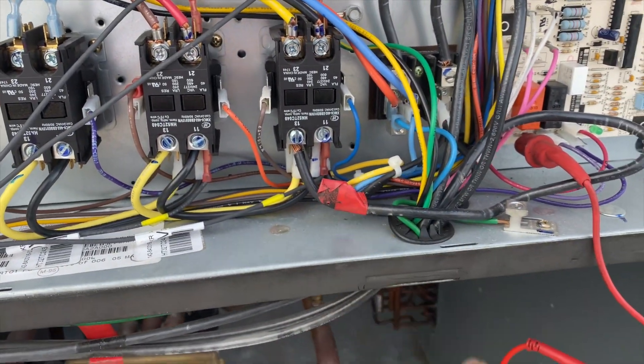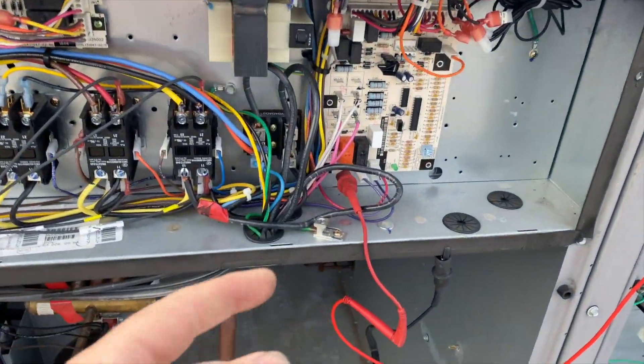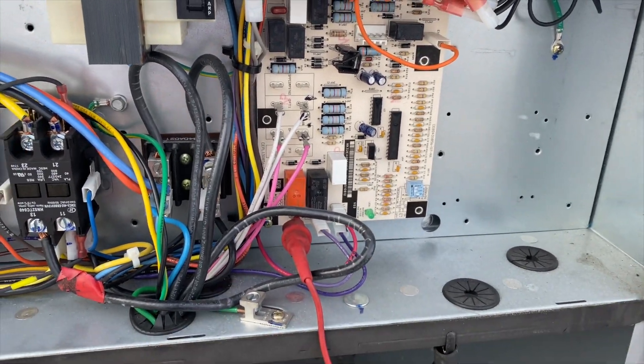When I remove it, now we don't have voltage. This is what controls the contactor. The reason the fan is running non-stop is because it's all plugged into line — there's no relay to turn it on or off. All we have to do is take one line off, put a contactor on that, and run a common.